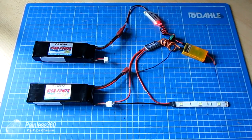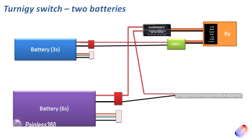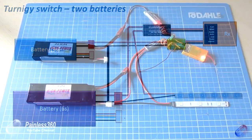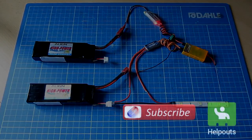So if you're going to run a separate load with this switch, you have to connect the negative side of both power sources together so you have a common ground throughout the entire system for this to work. In diagram form, here are the two packs together — very similar to what we have on the bench — and here is that connection you need to make between both for it to work. Hopefully that saves some of you some head-scratching and answers the questions for those subscribers who were interested in getting this sorted out. If you have any questions, please comment and post them. Thanks for watching — happy flying!